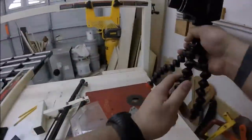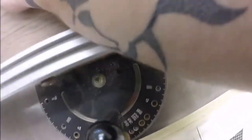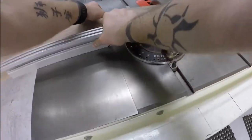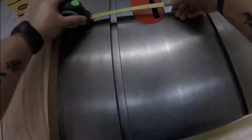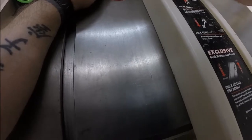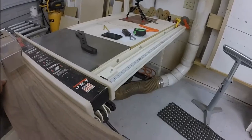Now I'm going to cut three of my pieces out for my entire project: two pieces for the long stretchers of the mirror frame, and then one long extra piece to cut in half for my two short ends. All three pieces are four and a half feet, which allows room for snipe. Snipe is when the board rocks inside the planer — there's no great way to get rid of it, but you can compensate. I know my planer's snipe on both ends is three inches, giving me roughly six inches of waste. Thankfully, this board only sniped on one end by lifting the board on the outfeed side.